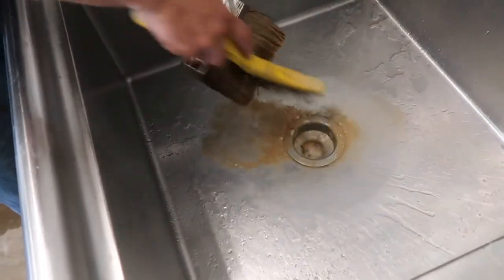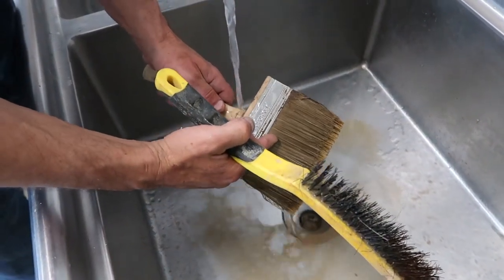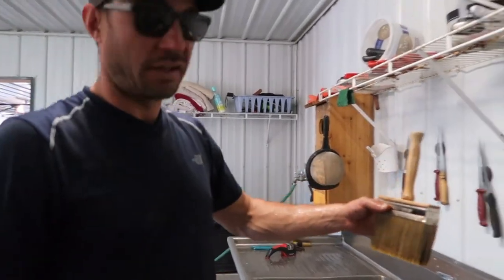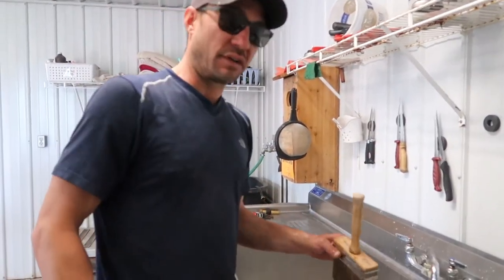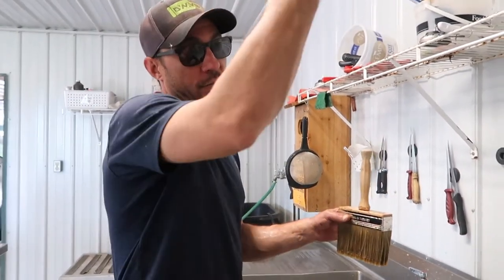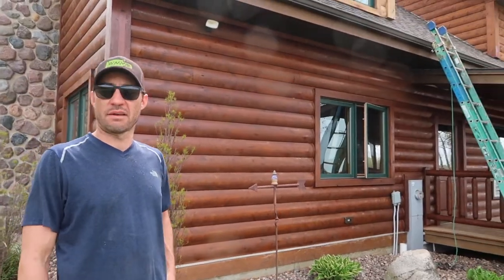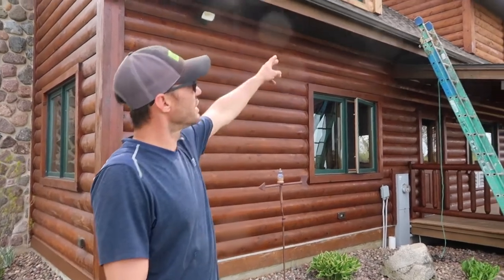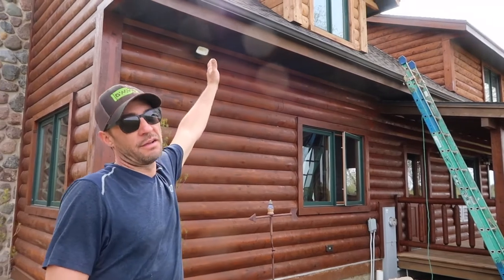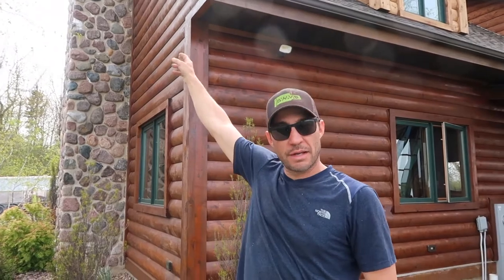Here's the best way to clean your brush. This is called the heel of the brush — not the keel, the heel. Another thing you don't want to do is leave your brushes in water overnight — they will not be clean enough the next morning. Shake them out extensively if you did try to do it. The heel tends to soak up all the water, so when you start staining, water starts coming out of your brush and you don't want that. Two coats put on the high side. We also got one single coat on two of the top dormers. We still have this dormer above to get two coats on, and two coats on the fascia board on this face. Rain tomorrow — back here Monday to finish it up.